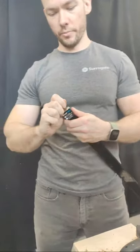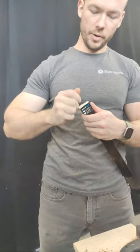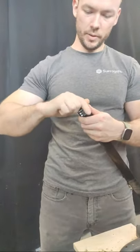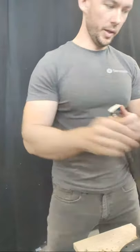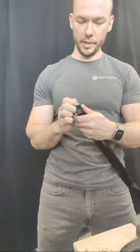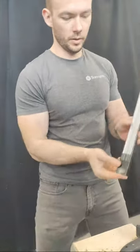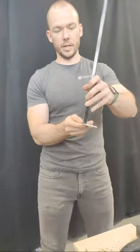But the problem with this is, for sure, the more volume or the more mass you have on top, it's going to make more come out in the beginning and potentially also work against the servo. And then when it gets lighter towards the end, you're going to have less if you use the same parameters of the servo speed as you did in the beginning. But let's see.